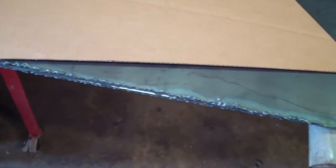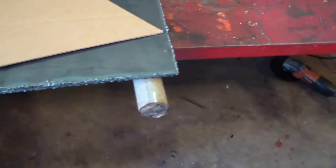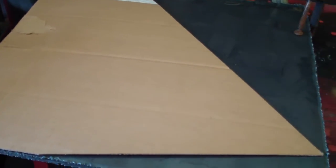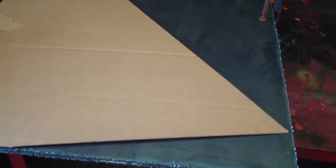Looking at it from this side, this angle here is parallel with the angle up on top, so that when this is parallel with the ground, I know this part is too — I know when the bottom is level. Because if you're pointing your bucket down into the ground and it wants to hop along and skip, this way it'll grade off maybe only an inch at a time. By the time you come across five or six feet, your bucket's full. It's not like you have to gouge into the ground — you just keep working your way down, and that keeps it nice and level.